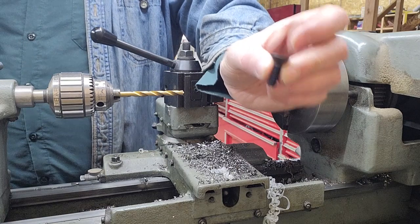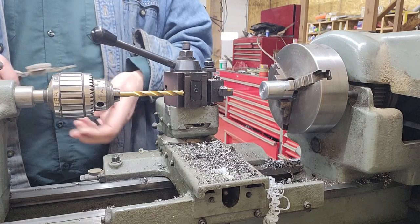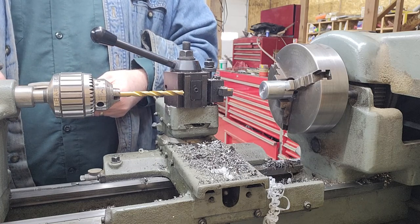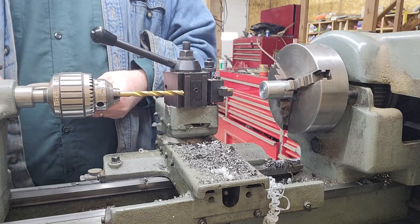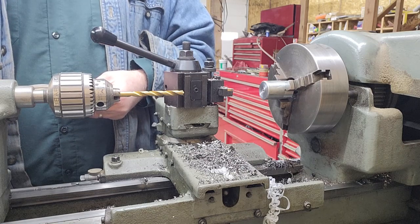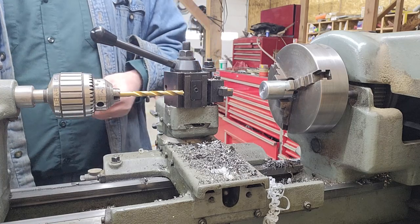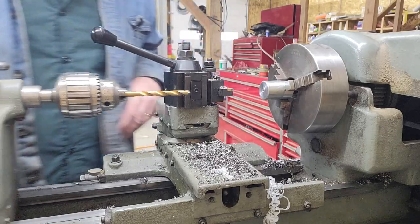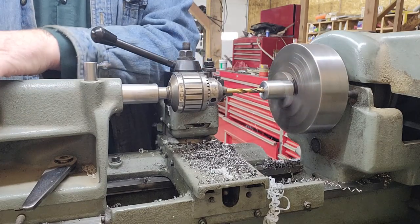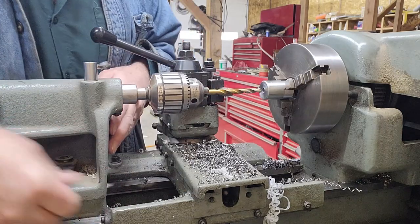This is the screw that I'm going to use to hold those in. So I'm going to measure what the total depth of the countersink is, so I have a ballpark idea of how thick I'm going to make them. That's like 198, right at almost 200 thousandths. So I'll probably machine these about 300 thousandths or so thick, for both of them.